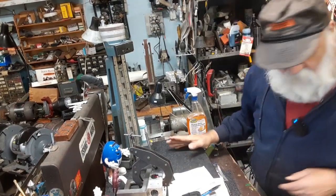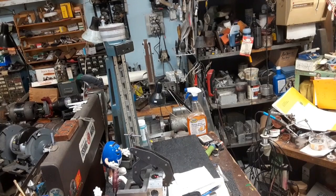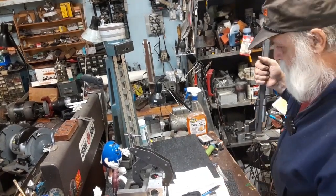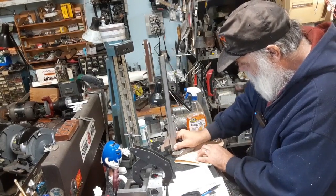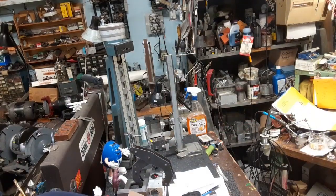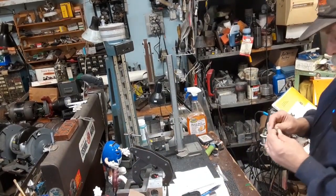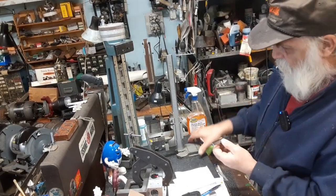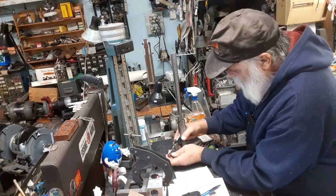All right. And we got to get the height stand with a scribe. I have one set up over here, I believe. Oh, I don't anymore. I'll have to hunt up the scribe. The scribe is missing. Just cleaning the bottom. Hopefully it's in my toolbox here that I put it away. Ah, yes it is. I have a carbide inlaid scribe that I made that I like. So we'll take that and put that on here. Indicator holder, and we'll put the scribe in there.